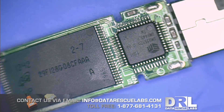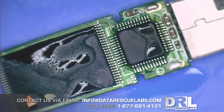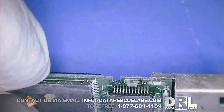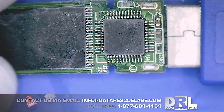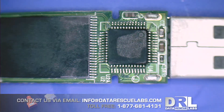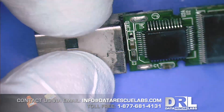Let's have a look under the microscope and check some capacitors. I definitely felt heat from this side, which is suspicious. Let's plug it in and see exactly what gets hot — right there, that capacitor is the one heating up. So the next step: we're going to remove it and see if the drive works.